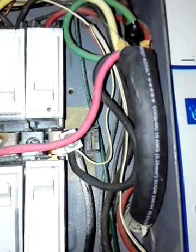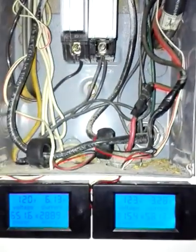On my other side here, if you follow it up, you can see how it branches down. It goes up, I have it here, and it branches down — the white wire with the red — and it goes to the other hot, which gives you the 240. Then the other wire comes around and goes into the common. Same thing.